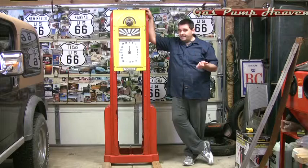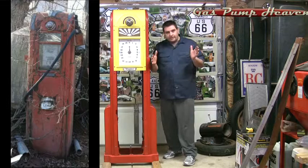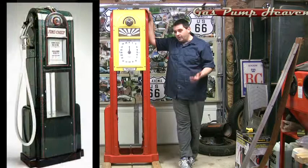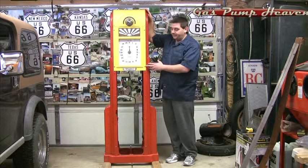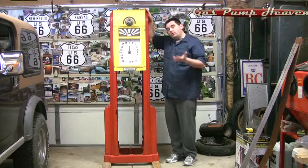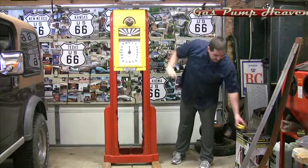There are a lot of different models and they all look almost identical. There's a Wayne 60, which is what this one is. You have a Wayne 60A, which doesn't have the humps on either side — it's a straight model designed for narrower, smaller islands. You have a Wayne 60C, which is a wider-based model, and then a Wayne 60S, which has the display front on it. You also have a Wayne 866, which is just like this — an 866 has a computer clock face on it, while a Wayne 60 has a metered face. Then there's also an 866C, and the C model is wider.